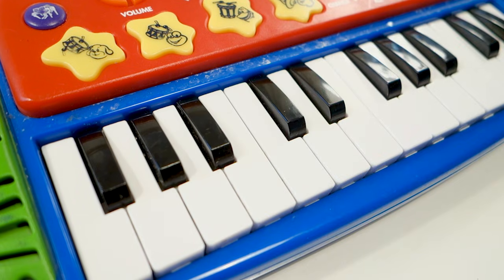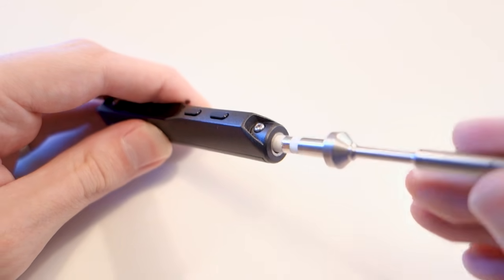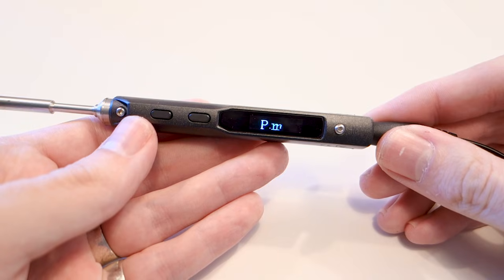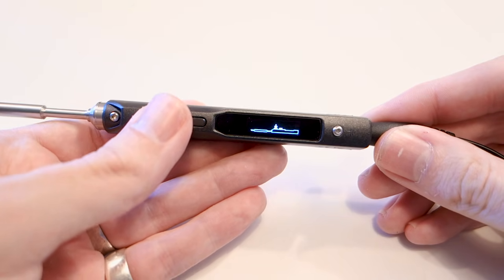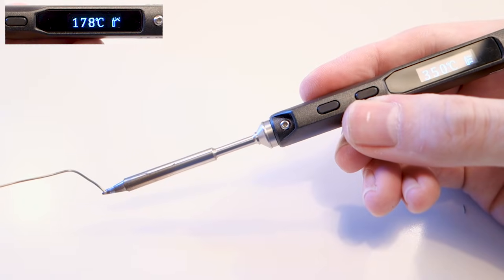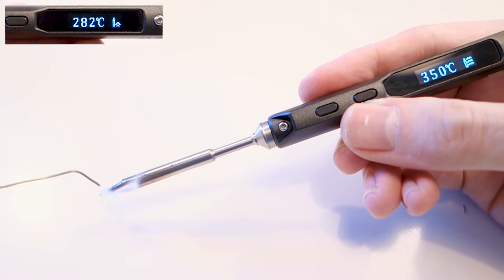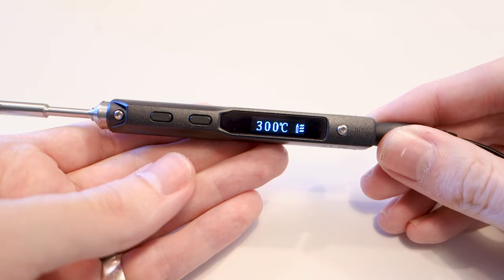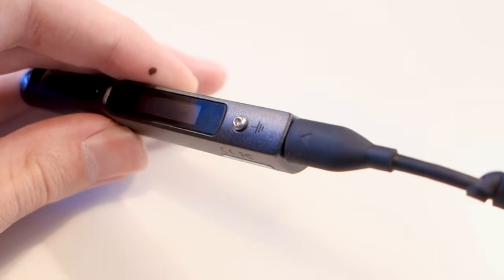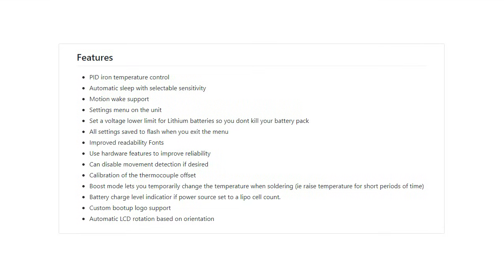You made it through — you're alive and hopefully your eardrums are intact. Let's close up the chapter on the TS100 soldering iron. I've used it now for a few weeks, and aside from this project I've used it to desolder components as well as build some other small circuits. I have to say that I'm thoroughly impressed — I'm used to running a proper Weller soldering station and while those are truly great irons, this is a serious contender. Not the least because it's so small — I can easily bring it with me whenever I may need it. Another cool feature is that because it has a USB connector you can upgrade the firmware, and you're not just locked into the manufacturer's firmware either — people have made their own custom firmware that unlocks a lot more options and features.